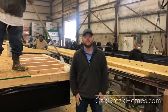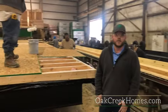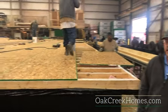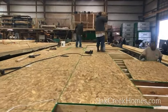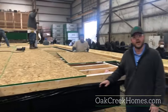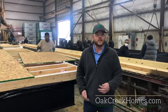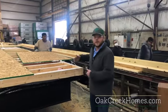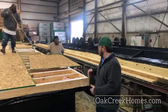It's a great value and why you're going to want to make it home. Here we are in our flooring department. The biggest takeaway is that we use a 2x8 floor joist on every home that we build — whether you're purchasing a 1-bedroom or 2-bedroom Smart Cottage or any variation. A lot of our competitors use smaller floor joists like a 2x6 with larger spacing. We use 16 inches on center on our floor joists.